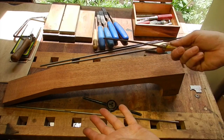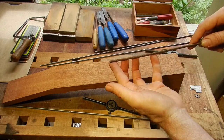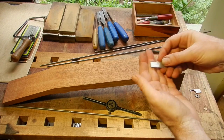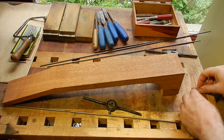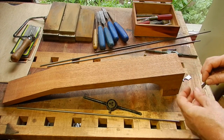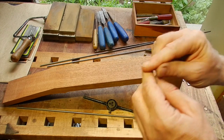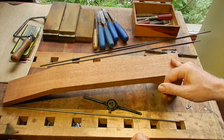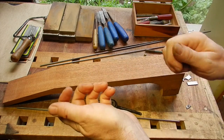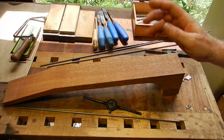I'll use a piece of the same steel to gouge as a chisel, which will make a nice perfectly rounded seat for the truss rod because it's made out of a truss rod. For the washer and the stop I use a little piece of aluminum to make a washer, and then a little square stop that will get embedded in here. One of the good properties of aluminum is it's soft. The burr that you put in it gets seated nicely — it's soft, and also with the groove that you create, the rod has no interest in moving.